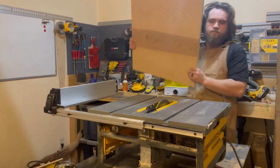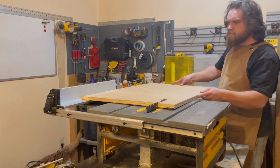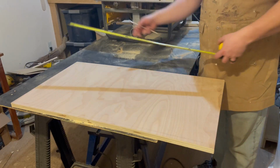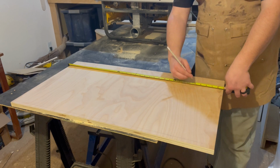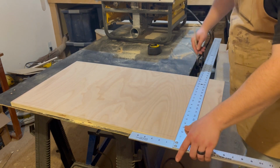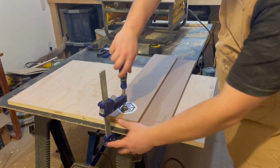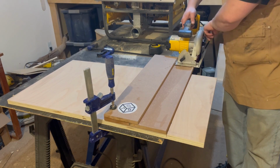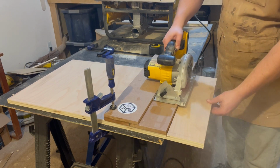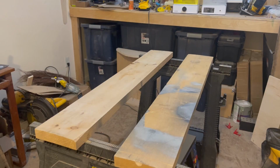Once my legs are cut, we can move on to the first layer of the top by cutting down some 3/4 inch plywood. I first cut it to the same length as my legs, then choose the width of my table. And to choose this width, I use the same criteria that I did to pick my length. Long enough that it will be useful, but short enough that I want to use it. And I went with 28 inches. Now 28 inches is too wide for my table saw to handle, so I'm using a circular saw and a homemade track to make sure that I get a nice straight cut. If you like this track and would like to make one yourself, we've got a video showing you how. Just check out the link below.